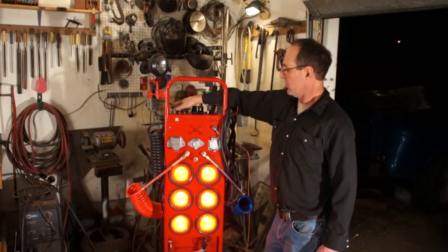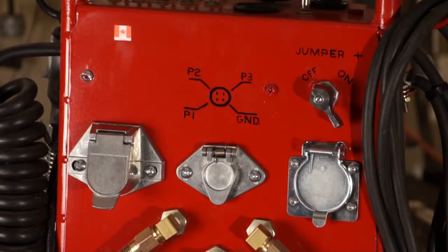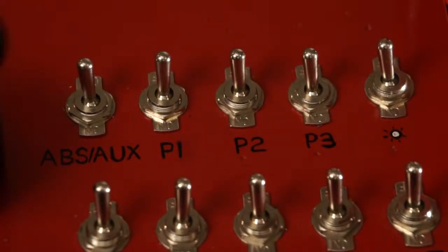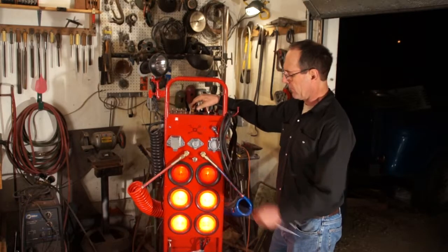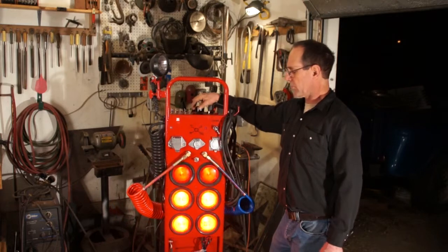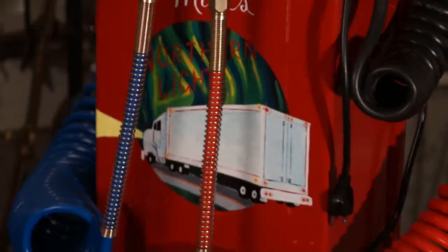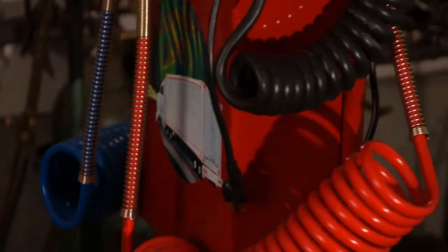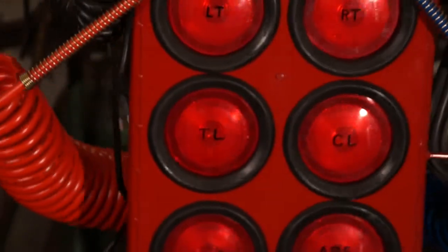This four-way is hooked into three pins — I have a label here showing P1, P2, P3 for the respective pins inside, and you have P1, P2, P3 here so that you can do whatever you want with them. These are often used on a commercial dump trailer or a pup trailer which goes behind a dump truck, where they'll have a four-pin connector to operate things like a tailgate trip or a tarp.